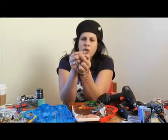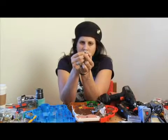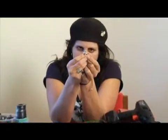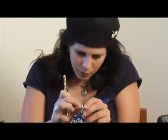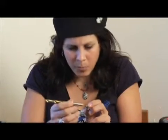This jack also has threads on it, and so it's actually a lot thicker than you think because of the threads. When you drill a hole into this case to accept the jack, you're going to want one that is big enough for the jack and the threads. So here I've got a bit that's about a 3/8 inch drill bit, and it looks like that might be about the right size.